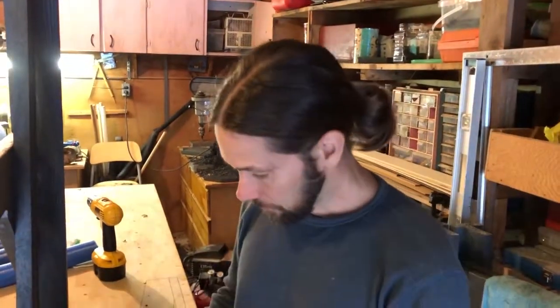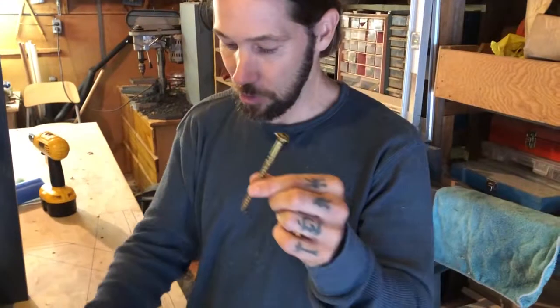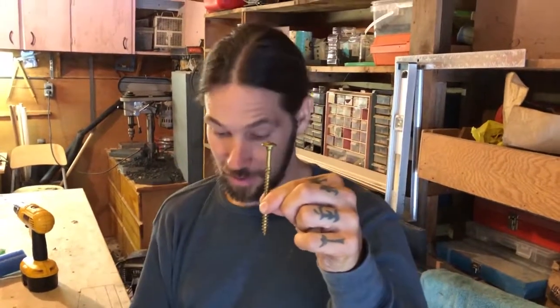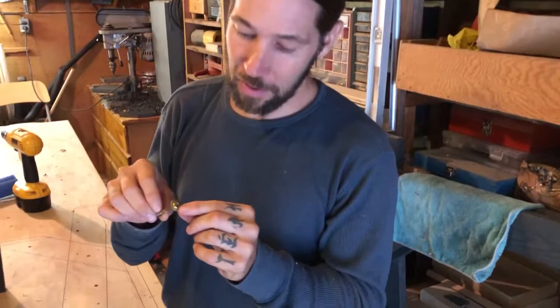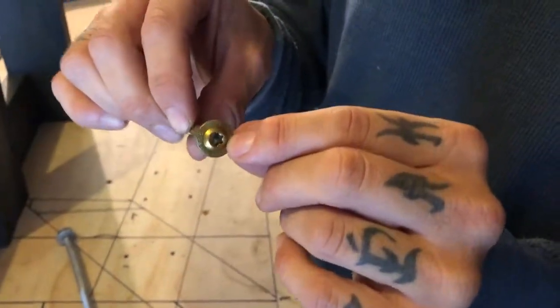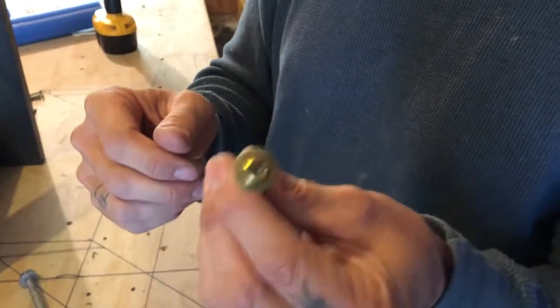Okay. One of our personal favorites, these are pretty cool. These are called structural screws. They're basically like a heavy-duty version of the wood screw. But this replaces something as heavy as this. It's pretty amazing. Now they come with a very unique hexagonal head on it, so you have to make sure you get the right bit for this. And they're typically, these things aren't too cheap, but they do a great job.